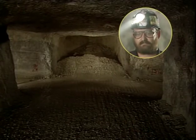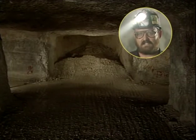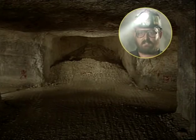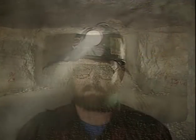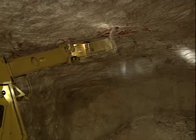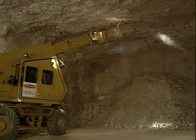I come in every morning at 5 o'clock and I pull my pre-shift. I'm looking for any sensors that are down, and any small loose stones in the roof, on the ribs, on the face, in the working areas where people are going to be working that day. After I'm done with my pre-shift on the faces, I'll check my runways and escapeways. Your pre-shift never ends — it runs from the time you get to work until the time you go home. You're always checking a room because through the day, people are going to be moving into other rooms or other face areas, so you must keep checking as the day goes on.